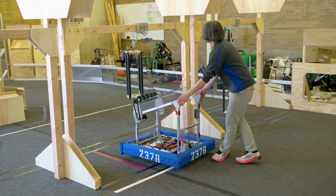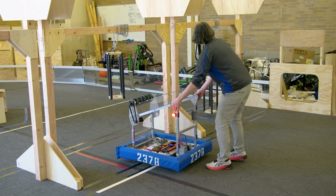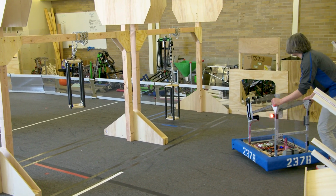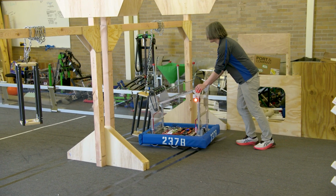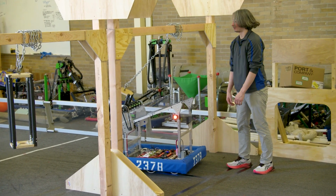So that's not good. And remember, there's 2 heights. So this is the high height, which is perfect to basically decapitate our robot. The low one has other problems as well. If we go through the low one, it starts out nice with bumper contact. But as we keep going, that is now basically dragging again on our roller.